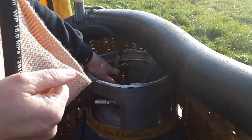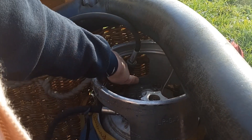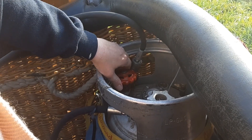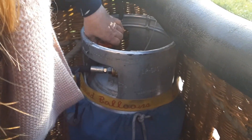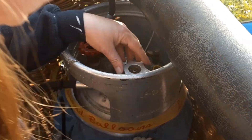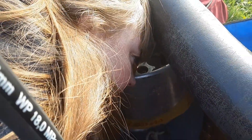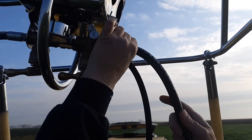So what are you going to do now then Alex? I'm going to turn on my cylinders and I'm going to sniff and check for leaks. Can you hear any hissing? Nope. Give it a good sniff. Turn on the next one — again give it a good sniff, can you hear any hissing? No. And just go your way up the pipe and check the connection to make sure there are no fractures in the pipe and no leaks.